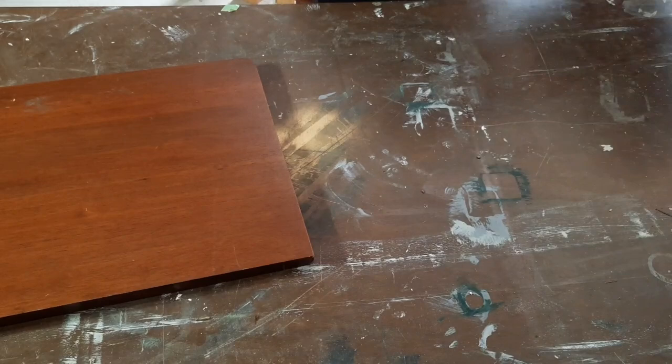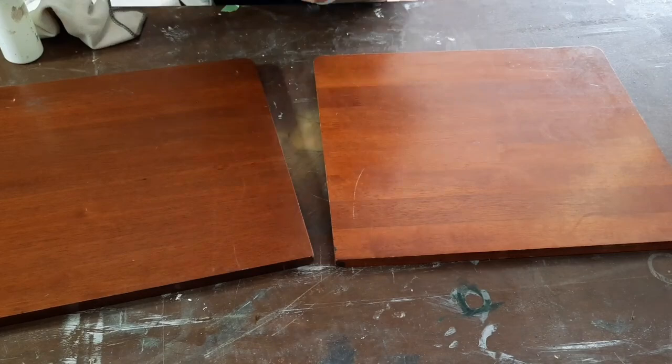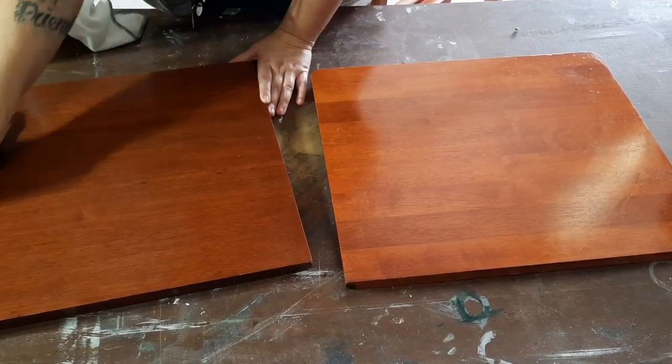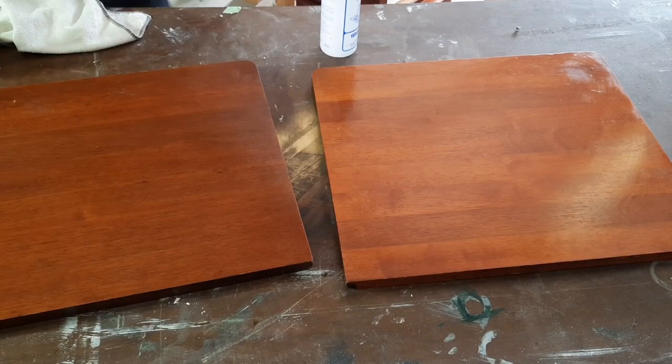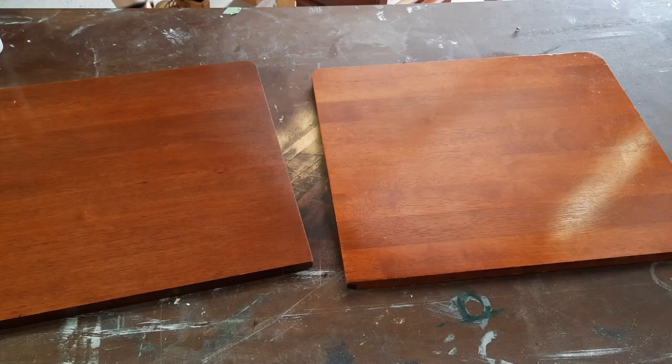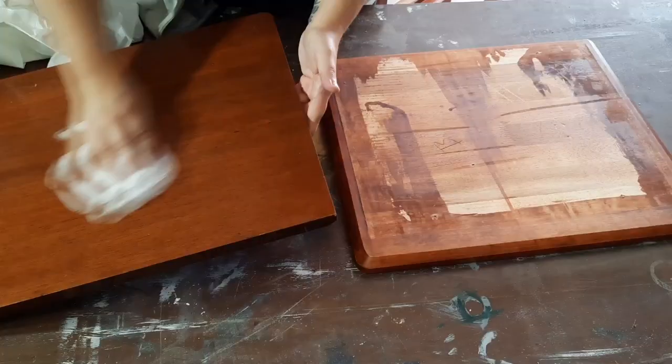I think this has to be one of the most overlooked aspects of furniture flipping. Cleaning has to be one of the most important parts of what we do here. And if you skip this part, there is a good chance you will end up with a really bad finish and you will probably have to go and do it all again. So I use Cuts and Millie Clean Cut to clean all of my pieces, and I'll put a link in the description for it. I go over it with the cleaning product first with one rag, and then I go over it straight away with a clean rag and clean water to remove any residue that might be left behind.